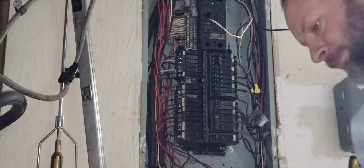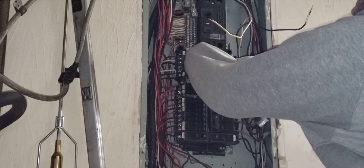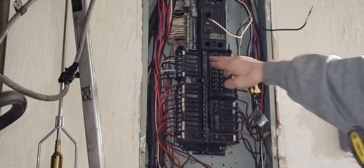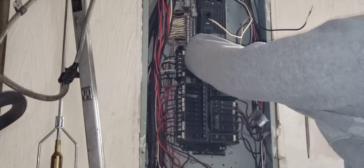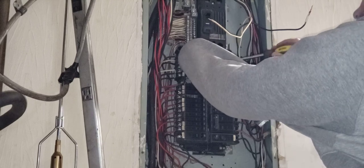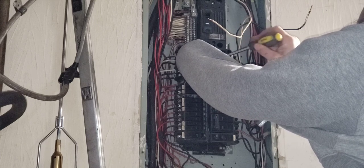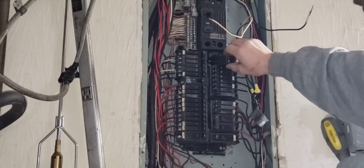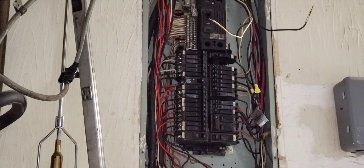I'm unprepared so I'll use my shirt as a cloth buffer, because I don't want to push on one side and accidentally take the other breaker out at the same time. I have to push hard on the adjacent side as I stick my shirt down in the slot. And here's the one I'm replacing — it's a General Electric.